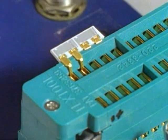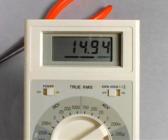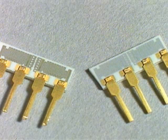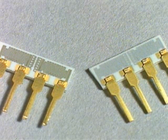Now we will repeat the procedure with the tantalum nitride resistor. Measuring the tanfilm resistor, we see that it shows a value of 14.94 kilohms. Note that although the two resistors used in the test are of similar size and configuration, their values are not identical due to the different sheet resistivity of the materials.